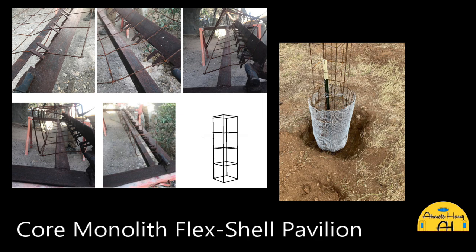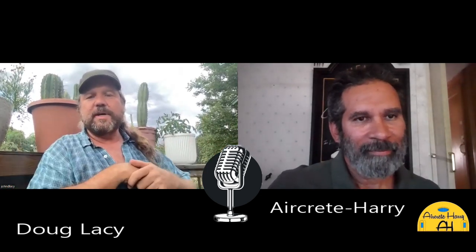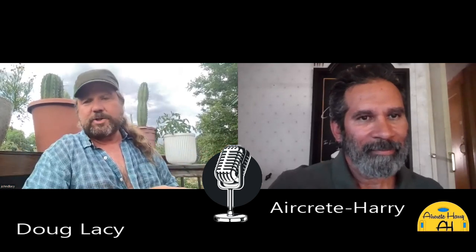The shape also makes roof gardens, and since you're building with columns, you can build in wild terrain with less disruption. You can just go right in and start building on the side of the hill with your columns. Then in the second stage of construction, you use that same high strength thin shell material to make retaining walls to terrace in around those columns. Then you do secondary terracing for your access pads and things like that. It protects that main pad from the columns, and then you just have a wall that goes up to the finished floor height. It could be a very short wall, only 3 inches high, but it establishes that level pad.